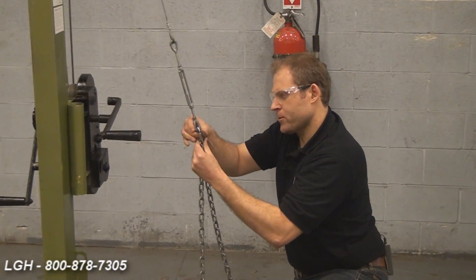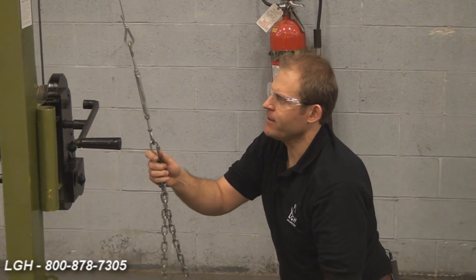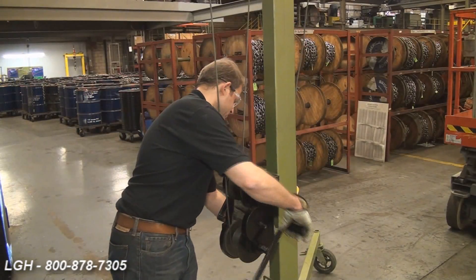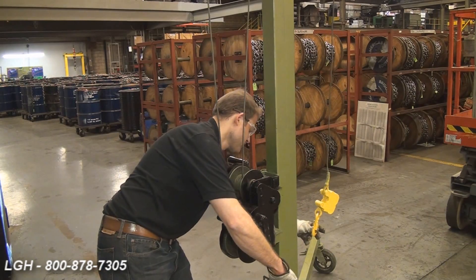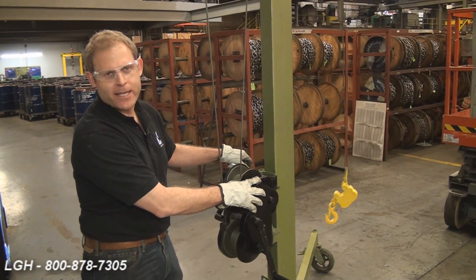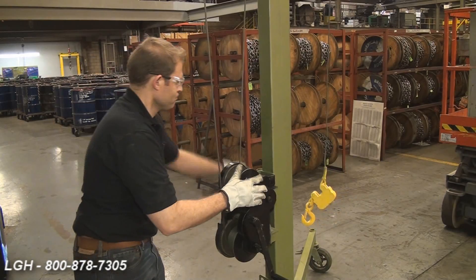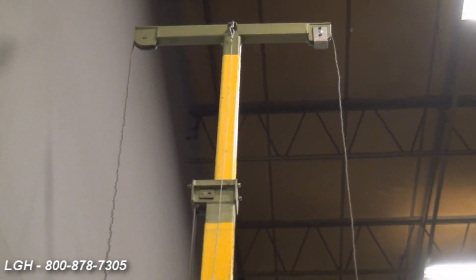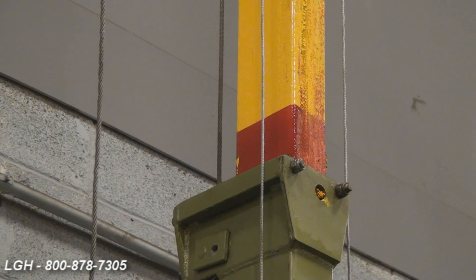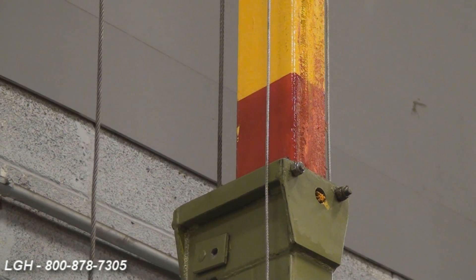We'll connect this to the rapid link of the wire rope that we've already installed to our mast, and repeat the process on the lug of the opposing leg. Once this connection is complete, we'll elevate our mast to our desired height. If there's any further adjustment, we have a turnbuckle here that we can use. First, release the hook. Next, we're going to elevate the mast to 10 to 12 inches below our desired height. Please note the 20-foot level is indicated by the red painted portion on the vertical mast.